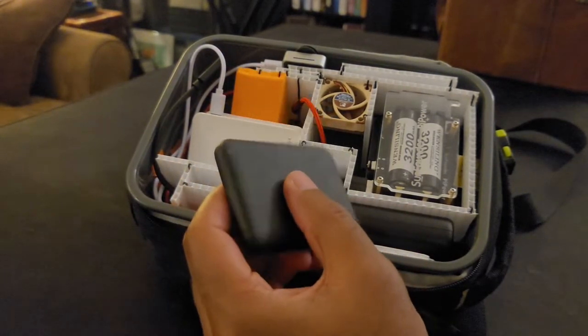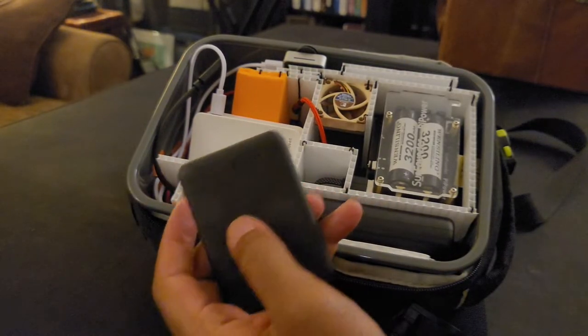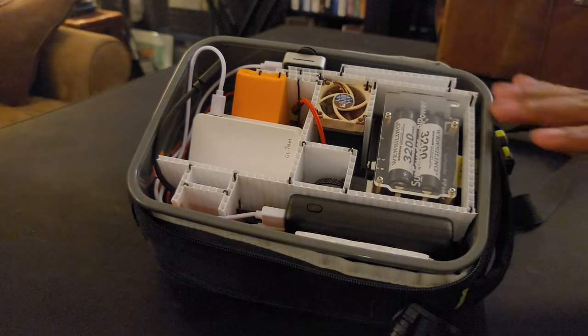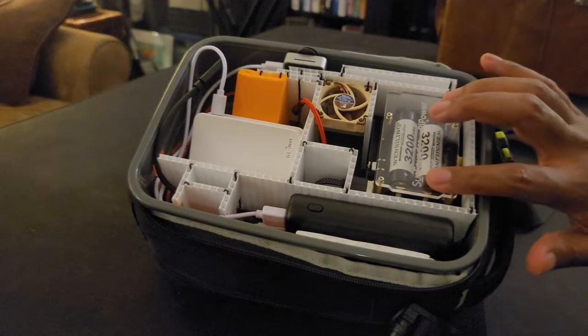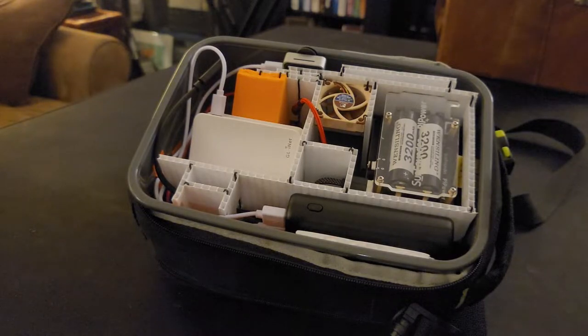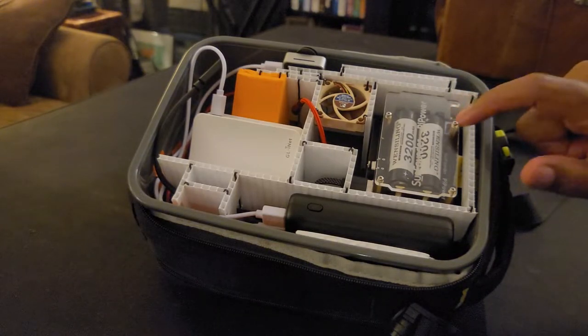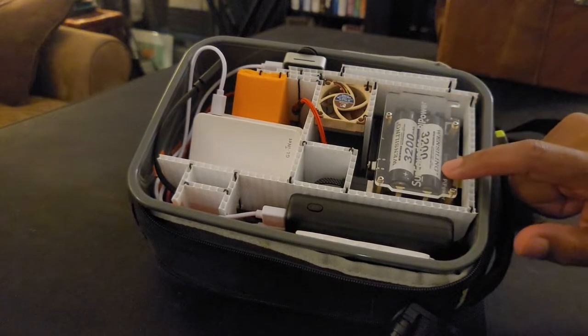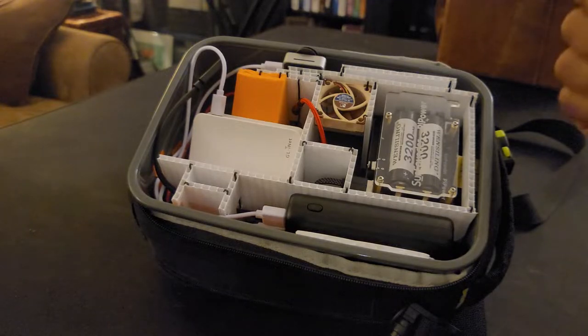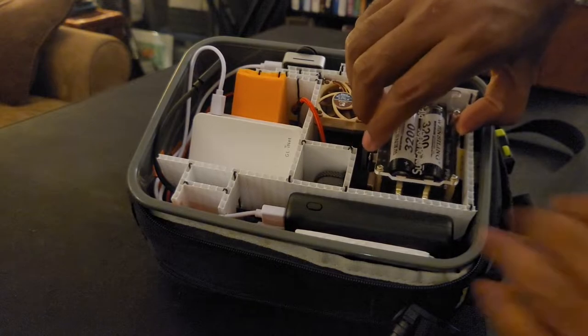The target is about 2.5 amps, but at least two amps is what it needs, and the old bank just barely wasn't cutting it — probably 1.5 amps at best. The problem was the Raspberry Pi 4 could be powered from it, but eventually if it was doing anything even remotely intensive it would just power-cycle, which is not good. On top of that, if I plugged in a monitor while it was on that power bank, I'd see the low-power lightning icon — things you definitely don't want to see.